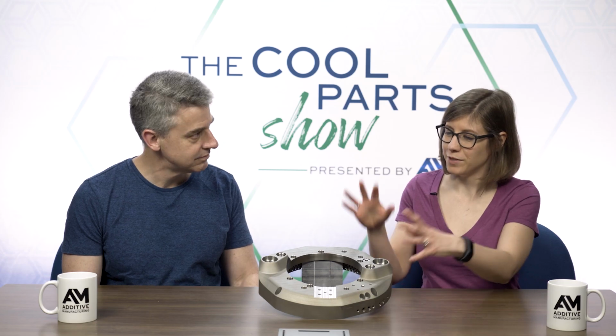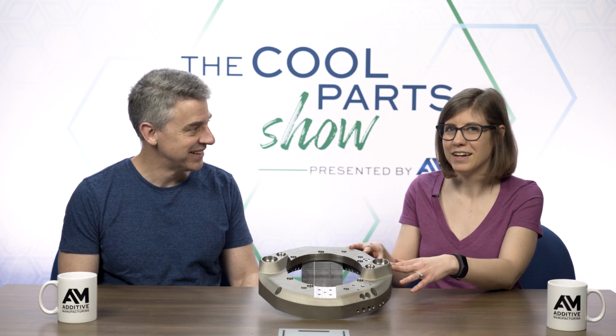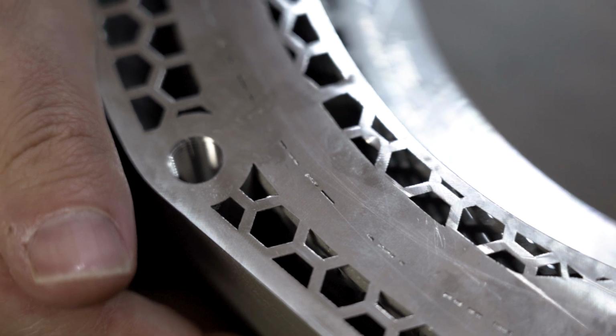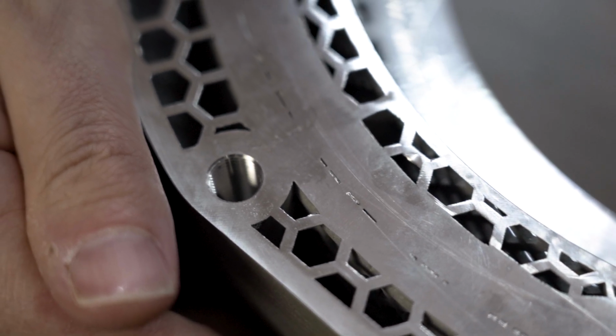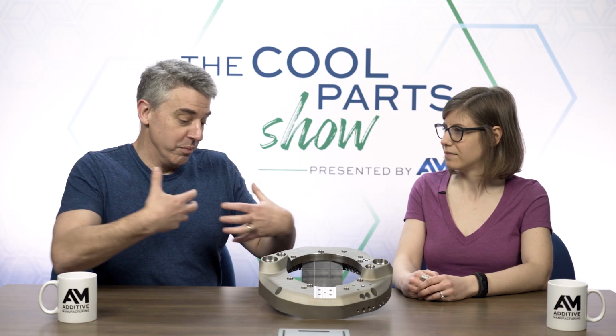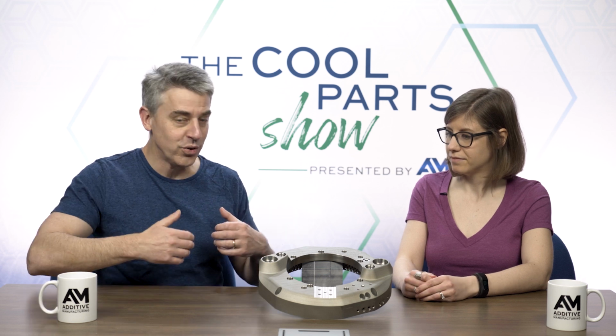So I think that's a pretty good visual of what's going on inside of this part, the Swiss cheese analogy. And when you think of it in terms of subtractive manufacturing, previously they started with a solid block of material, removing material to make those holes and then having to plug up the ends later. Now with additive, they can think more about building walls around the channels that they need and using less material, just putting it where it's absolutely necessary. So that's right. They were removing material. They were putting it back in the form of sealing these holes.